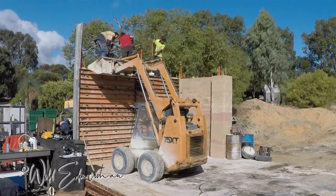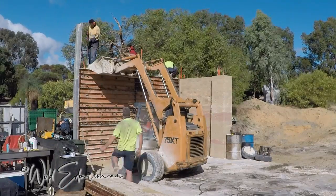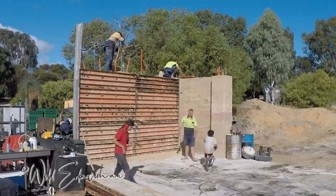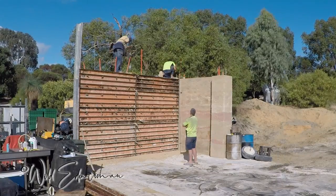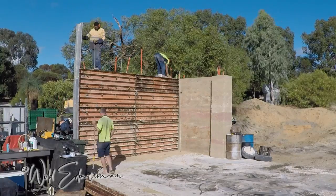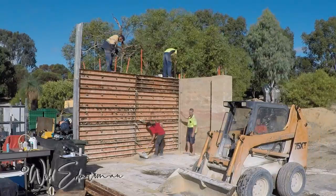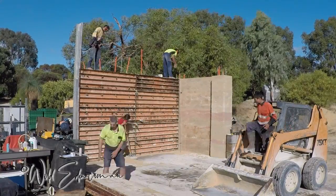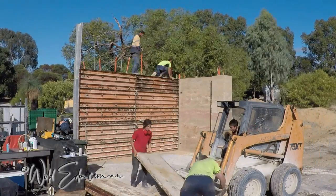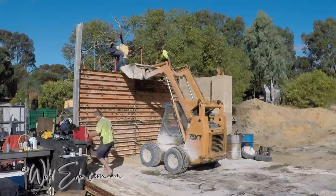Down low you might put a new form on when you're halfway up, or sometimes we'll put two forms on before we even start so we don't have to stop for the second one. When you've got the first two forms down you can actually stand outside the form and be ramming anyway. As you can see, the top of those forms is at three meters but the wall we're doing for the roof actually starts at a lowest level of 3.2 meters, so you can see they're putting another reinforcing bar in and lifting new forms up.